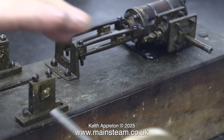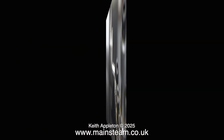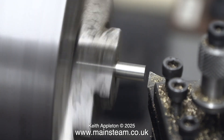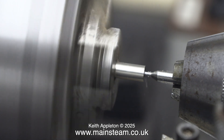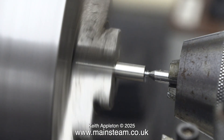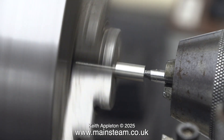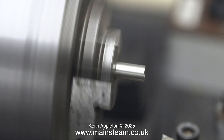If you look carefully you will see that I've reamed out the main bearings and everything fits very well. Over now to my Myford ML7R lathe, and I'm machining across the end of the piece I've cut off for the crankshaft. Once I've machined the end of it perfectly flat, I used a centre drill to drill a tapered centre in each end of the crankshaft. This is for decorative purposes only, to suggest that the crankshaft was originally turned between centres, which of course it isn't — but it looks quite good, a bit of authenticity in a small world.